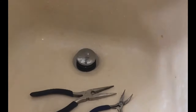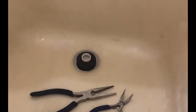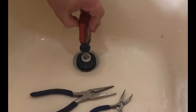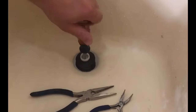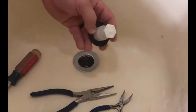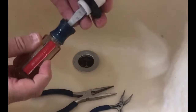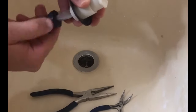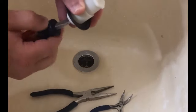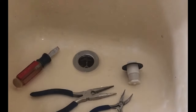To take this apart, all you have to do is take a hold of this, spin this out, put the wide blade screwdriver in here, and unscrew it. Once you unscrew it, you'll notice that the screw has kind of gone up inside a little bit. You can crank it right back down — you can see the screw — but it will bottom out. You'll have to start it at the bottom when you put it back in. Then we'll start taking out the hair that's down in the drain so that it'll start draining correctly again.